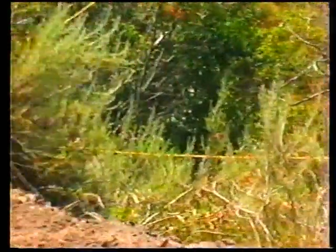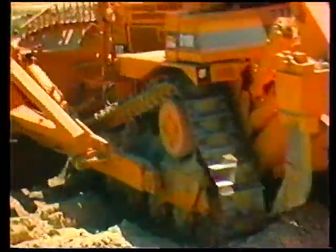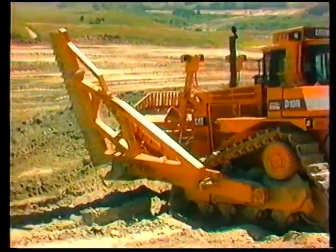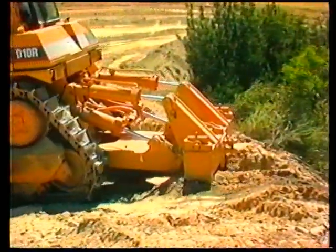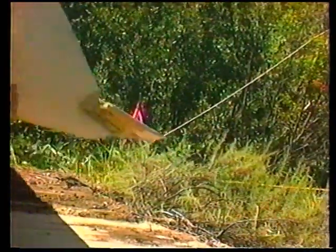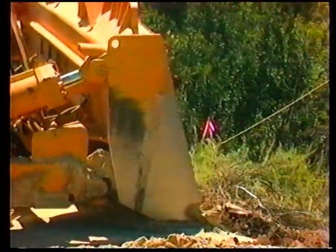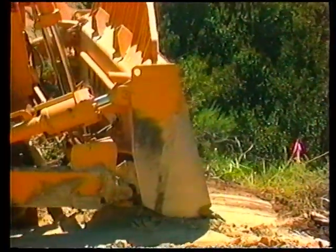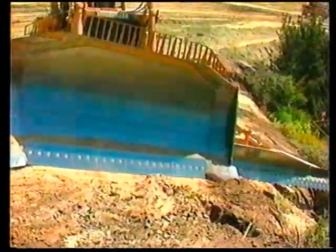If the slope that's being trimmed ends at daylight, no excess material must fall beyond the daylight point. Approximately one dozer length before the dozer reaches the daylight, turn the dozer and the slope board away from the slope and lose any excess material over the bench and down the slope. Then locate the dozer at the end of the slope facing perpendicular to the slope. Climb the dozer up the slope and back drag the excess material off the slope at the proper slope ratio. Be careful not to undercut the slope.